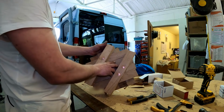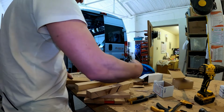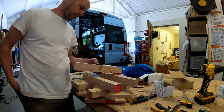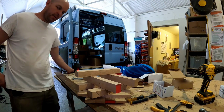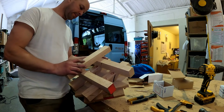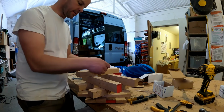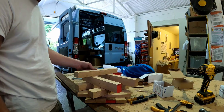So that's the frames onto the planking. Now we need the stringers on, but I might leave this for Gemma, because Gemma wants to gain some experience. I think that's going to work out quite well. On the original hull, behind the web frames, the frames weren't attached to the hull, because obviously you can't get access. But then you get the big copper fixers which attach the web frames. So, beauty.